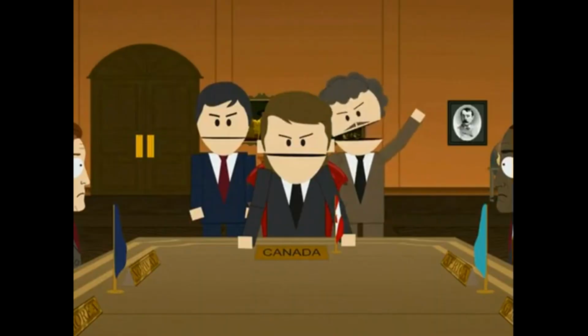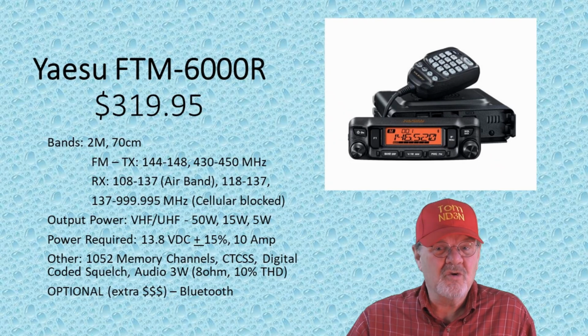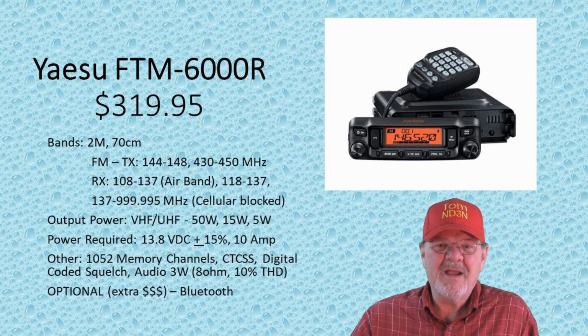Yeah, no money. The Yaesu FTM-6000R is a dual band, 2 meter and 70 centimeter FM radio. Its cost is $319.95, and it transmits on 144 to 148 and 430 to 450 megahertz. It receives 108 to 137, the air band, then 118 megahertz to almost 1 gigahertz.